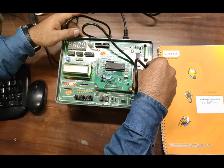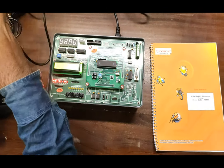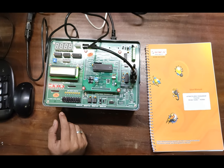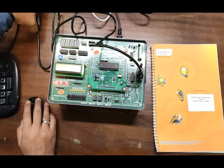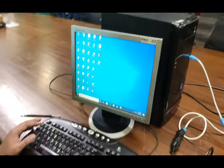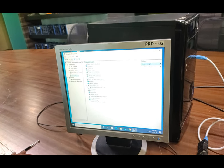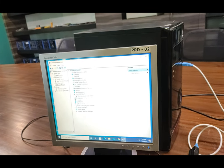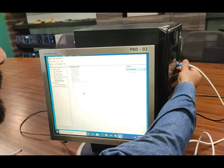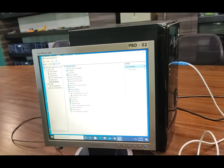One end will be connected to the RS232 connector of this trainer board, and the USB-to-serial converter will connect via USB port on the PC. After connecting, first check which COM port your USB-to-serial connector is showing. Go to the Manage section, open Device Manager, and under Ports the COM ports will be shown. As I connected the USB-to-serial CH340, it is at COM3, so we need to remember COM3 for use in our software.